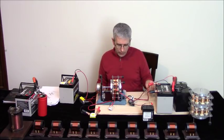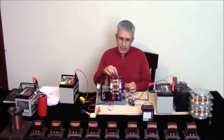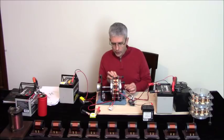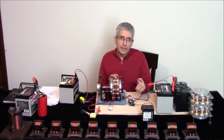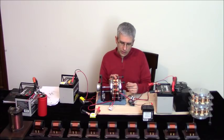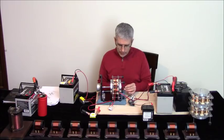the only thing that I don't have on this kit right now is the ability to mount the hall switch. You can mount it off of one of the legs here. It can no longer fit between the frame and the rotor because, for one, there's no room. Two, I never had this hall switch under the motor coil because it's south pole turned on, and when you are pulsing the coil, it has its own pulse, and it throws the whole hall switch off. So you could never really run the hall on that side of the motor coil. On the rotor side, you're going to have to run it. So you could easily run it on any of these four legs here if you put the motor coils on the corners.